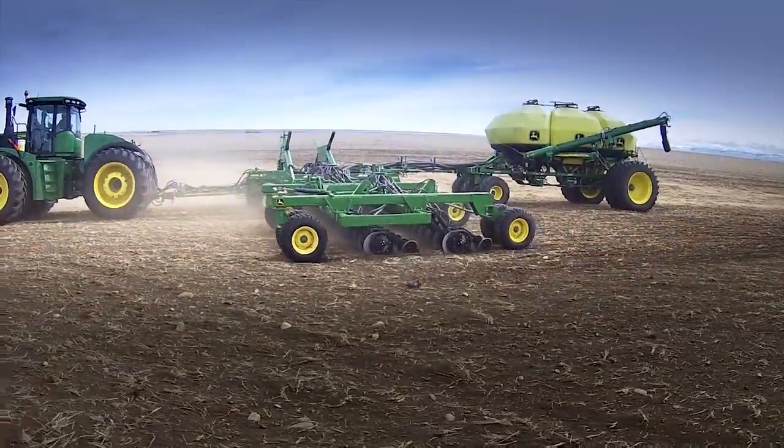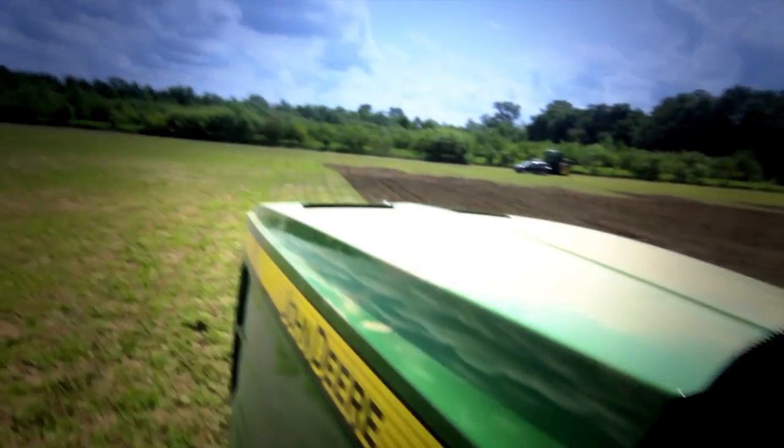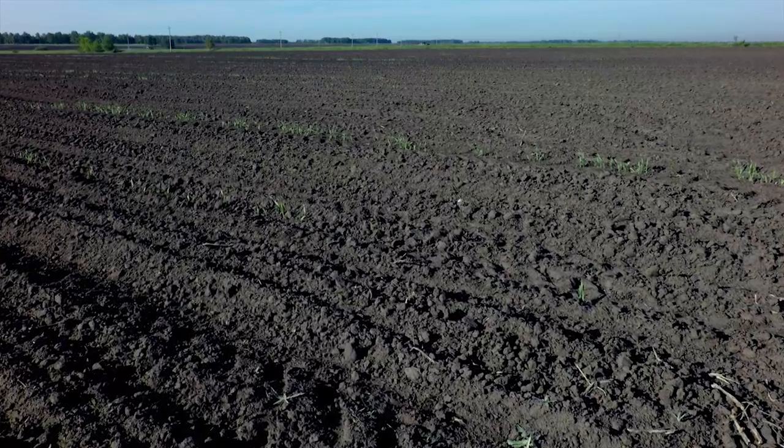When you're pulling a large load in the field and your tractor slips, then it gains a bite of traction, and it slips again — the machine actually starts jumping up and down. A big problem. You get going over six miles an hour, the tractor would start hopping up and down, creating compaction, then lost traction, and then eventually lost productivity.